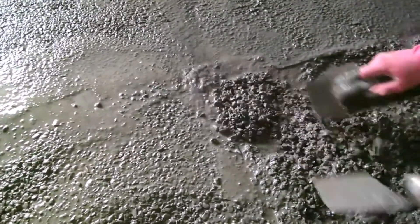There should be an even thickness of 20 to 25 millimeters of terrazzo across the floor. After initial preparation has occurred, inspect the concrete for bug holes, voids, fins, and other imperfections. Protrusions shall be ground smooth, while voids shall be filled with a general polymer system filler.